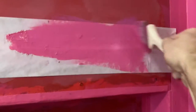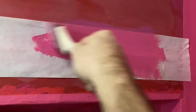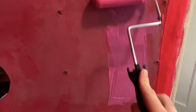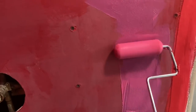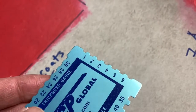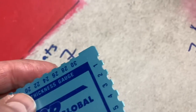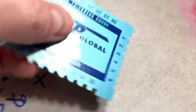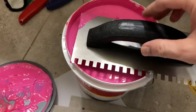The instructions for my particular application — a vertical shower wall — call for a trowel application, and I was really afraid it would go on too thick. One of the big reasons RedGard fails is if you put it past a certain mil. A mil is a thousandth of an inch, and this is a wet mil gauge, so you're definitely going to want to pick one of these up — I'll pop a link below.